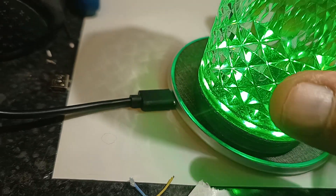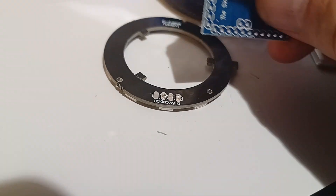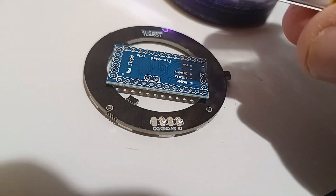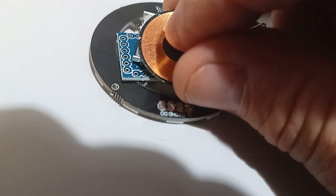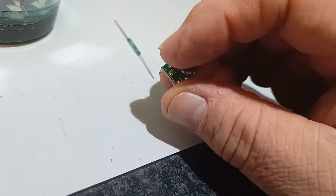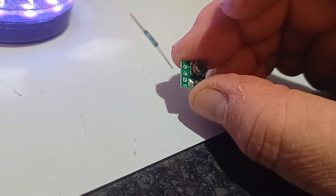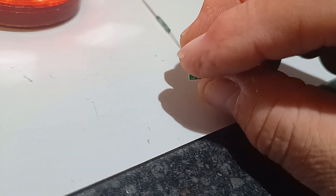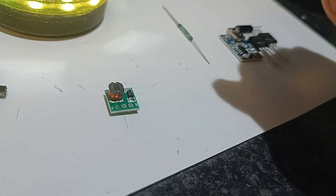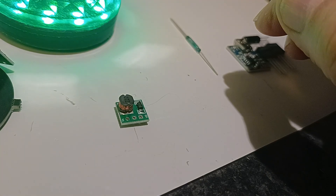That coil is embedded right in the bottom of this. So we have a little build-up of layers: the ring on the bottom layer, then this, then this on top of that, and this would sit on top of that — it's all glued together. That's our boost-buck converter. This is the thing causing all our problems with going to sleep. It converts 3.7V up to 5V for the Arduino. We could have used a 3.3V Arduino but I'm not sure whether that can withstand 4V on a full charge. We just need to put another MOSFET in there so we can connect the battery direct to it — 3.2V is enough to keep the thing running in sleep mode. I just need to work out a way of doing that.